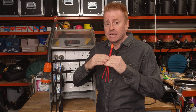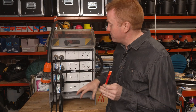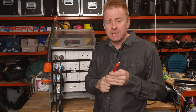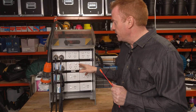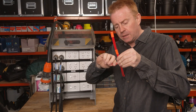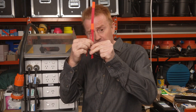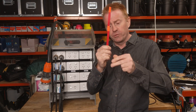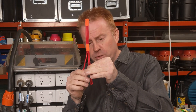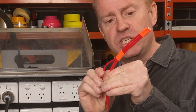When electricity goes through a cable it heats it up, and metal expands when it heats up and contracts when it cools down. If your three-phase box is equally balanced — the same amount of power on phase one, two, and three — those three cores expand and contract the same amount. But in this situation, everything was loaded onto phase one, so the other two cores had nothing going through them and didn't expand. So instead of all three cores expanding and contracting at the same rate, two were stationary — and as you can see, that kinks the cable.